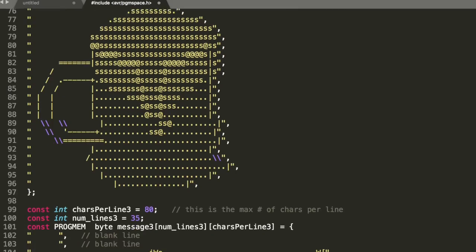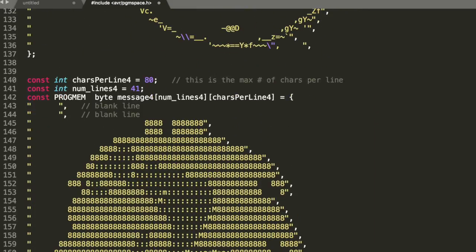So this is what I've come up with. It contains an Arduino Nano. It has a Centronics port that mates with the printer, a push button, and an indicator light. This has 10 pieces of ASCII art stored in it, and when you connect it to the printer and press the print button, the printer will print one of those 10 pieces of ASCII art at random — it just picks a random one and prints it. Let me show you how I built this thing and how it works.